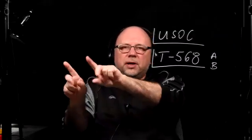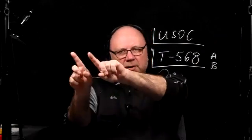When it comes to T568, which will be the data wires configuration, the pairs are counted a little bit different. And this is always, every year I do a little dance, and maybe somebody's going to write the music to it, or maybe not. So it's pair 1, pair 2, pair 3, and pair 4. Okay, 1, 2, 3, 4. All right? So blue, orange, green, brown. Instead of the USOC order, for T568: blue, orange, green, and brown. So here's my dance, and of course, that's the A configuration right here.